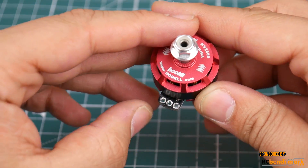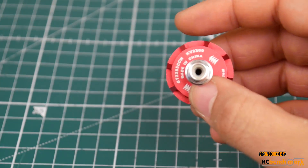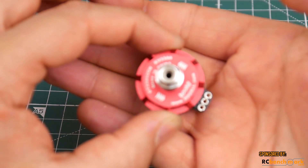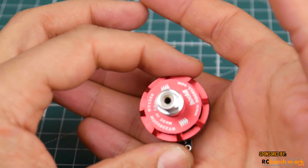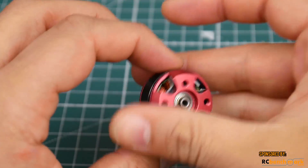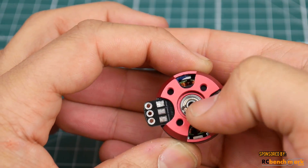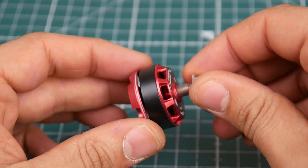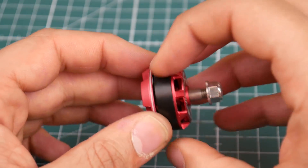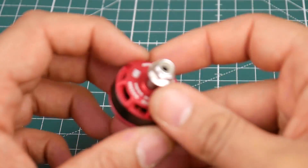The Hook LL has a little PCB protruding out where you solder your wires, making it easy to replace if the motor gets damaged. It has a hollow shaft, and on the bottom there's a C-clip if you need to remove or clean it. The gaps are pretty good, they're not using arc magnets, and it feels pretty smooth — just a little notch here and there.